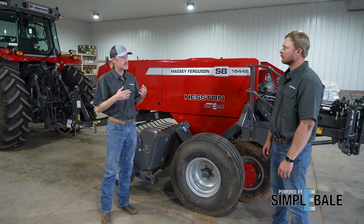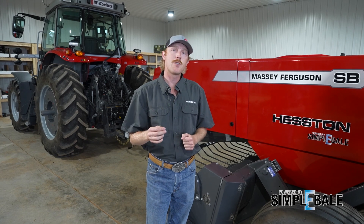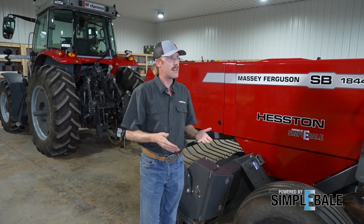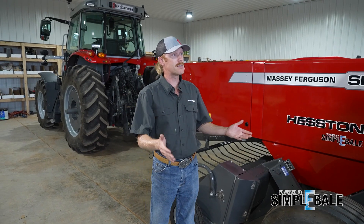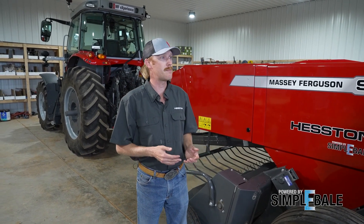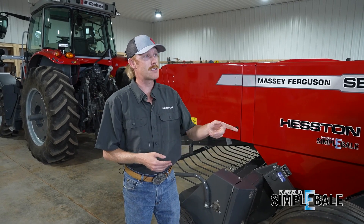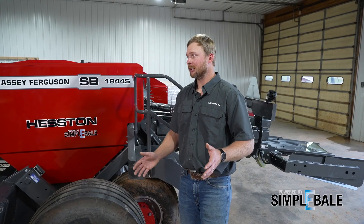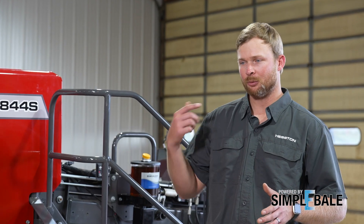From what I'm hearing, that flake counter is really going to allow me to optimize how this baler runs. It's going to allow my new operator to tune in his ability to run this machine — I can give him a target of maybe running 15 or 18 flakes and he can watch that number and adjust his ground speed as needed. The other really cool thing, if you think about that flake count, is bale consistency and what that does to the bale coming out the back of the machine. A consistent flake count is going to allow me to make sure that bales coming out are very uniform in length. If I target a 36-inch bale and I'm consistently hitting my target flake count — 15 or 18 — each time through that consistent ground speed, I'm going to get that consistent bale length. Consistent bale length — bale length is money. Everything is about consistency when it comes to either selling the bale or picking it up out of the field. I want that to be as repeatable every time.